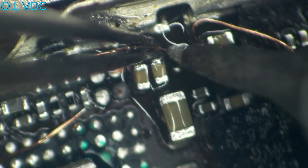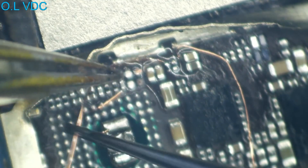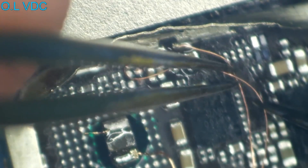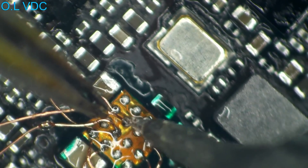I pretty well had all of the nuts and bolts jumpers out of the way, but for this chip to work we need some data communication. So last, I hooked up our I2C0 lines. One of these is the SDA line for the data, and then we have one more that is the clock line that keeps everything communicating in time.